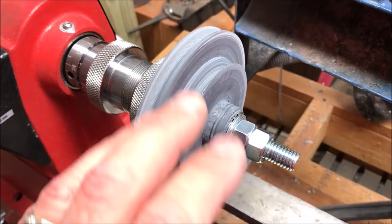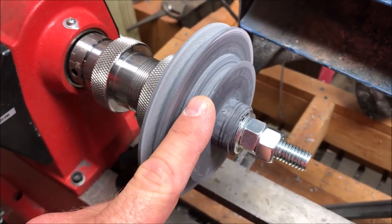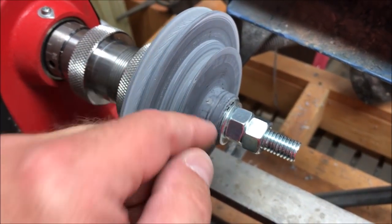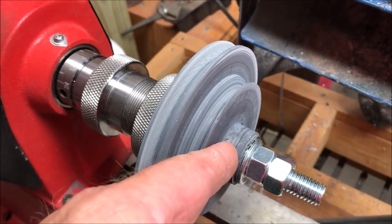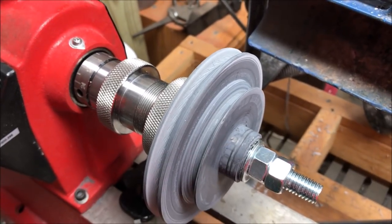It's humid out here tonight. I've switched gears while I let the glue dry on that pinwheel blank. I've been working on my pulley — you can see I've got both top and bottom pulley turned. I've mic'd them out as close as I can to the original pulley. See that little dot right there? That's where I'm getting ready to drill. There is a bronze sleeve in this pulley — I need to drill through this plastic into the bronze sleeve, and then we need to tap it.